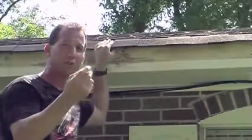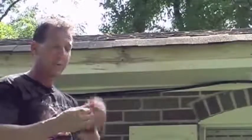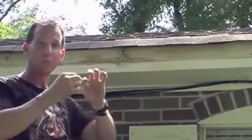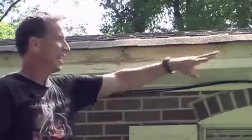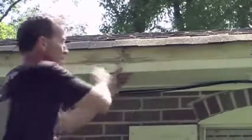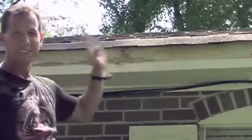This is why you never want to use bright nails on the exterior of a house. Bright nails will rust, and once they start rusting, they lose their grip — they get a little bit thinner and you can just pull them right out. All of these nails that are in here, I just pulled them right out. Now I have large holes, but the holes are easy to fix. All I do is sand this down, putty those up, and I'll be fine.